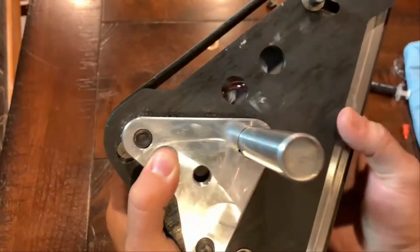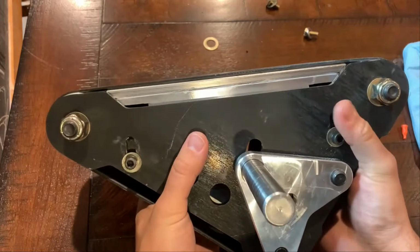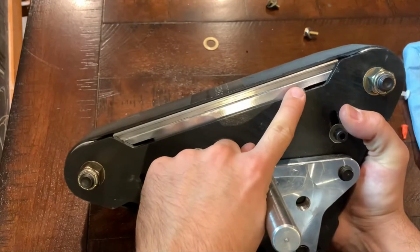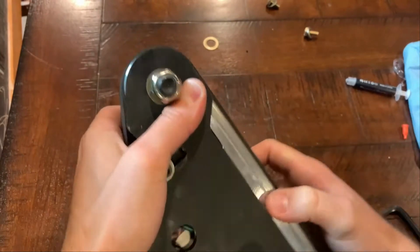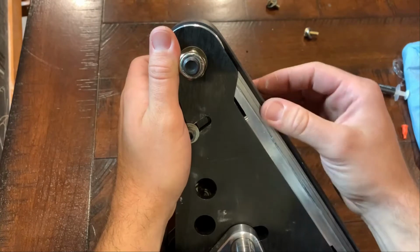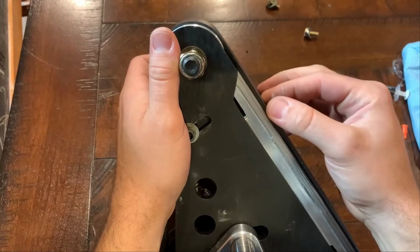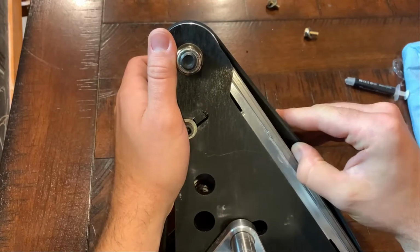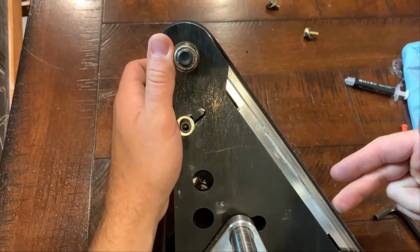One other thing I want to mention, because it was something I found was a problem when I got it. Nothing wrong with the equipment or with the platen itself. I didn't double check the actual adjustment of the platen, how it was sitting with the belt. When I got it, one end of the platen was kind of out a little bit. What that does is it puts pressure on the belt, extra friction when it's spinning, so it heats up a lot faster. Unfortunately, I probably caused a little more wear on the belt than is necessary. So when you get one of these, double check that.